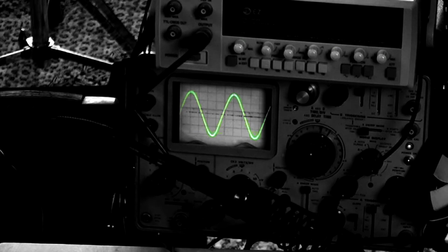With exception of the voltage. Oh, now it's actually, with the full load, 633 volts, so everything checks fine. If I stop the signal, it's 670. Alright, so that was the bias, that's why it was 750 volts. With the right bias, everything falls into place. Great.